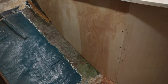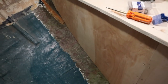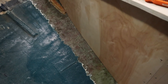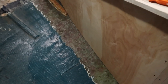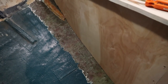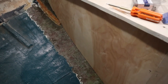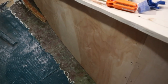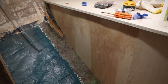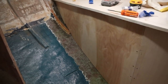I finished grinding that area out by this bulkhead, and it does seem to have a little bit of a reddish change to it. If it was something more structural, I'd investigate that a little bit more - I will ask some questions about it. But I ground it down fairly hard, so any contamination should be eliminated. I'm going to clean it up with some acetone, and also clean the plywood up with some acetone, and then start to create that fillet.